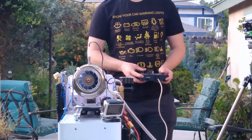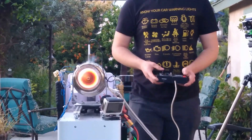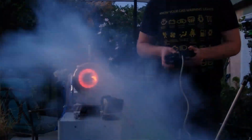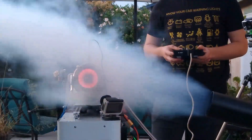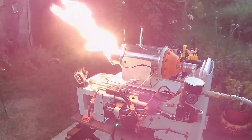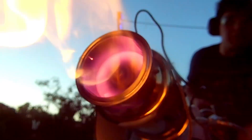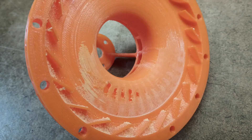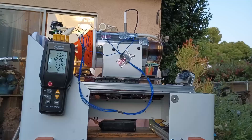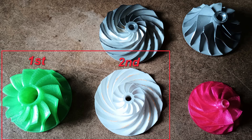Unfortunately, other problems started almost immediately. Even with these issues I tried to manually disengage the starter, only to be met with a stalled engine belching fire out the back. The engine failed because of tolerance issues with the compressor — when it got up to speed and started compressing air, the 3D printed compressor wheel was pushed into the housing, scraping away layers of plastic and exposing the cooling channels, causing the engine to quickly grind to a stop.